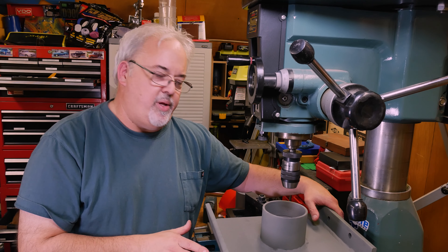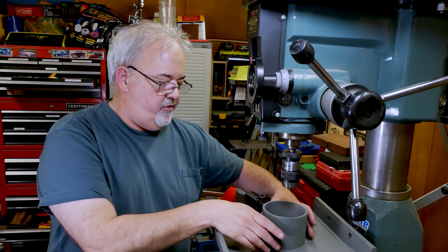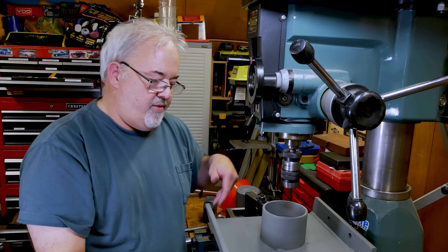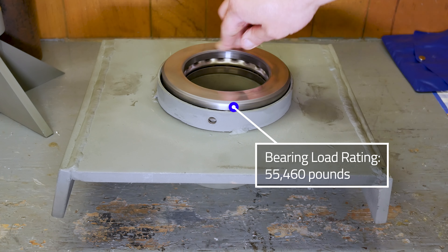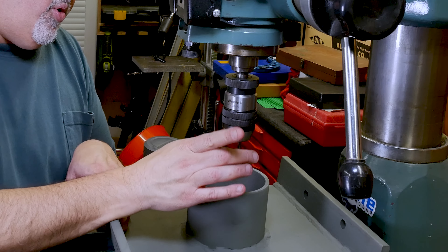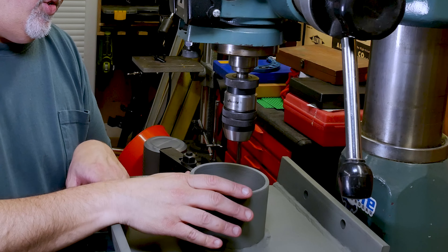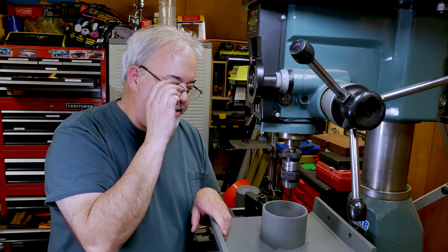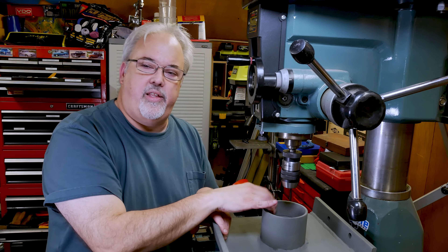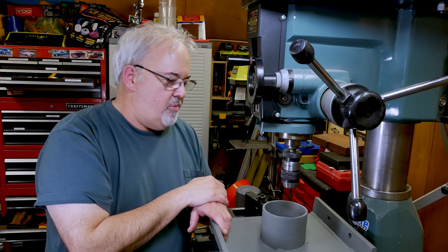I've taken the vise off of the milling machine and I've put this plate on here. This is the top plate of the ride, and this tube here is where the central shaft goes through. Now this is actually sitting upside down. The top surface here is where the bearing goes that the whole weight of the ride rests on. This tube right here is where we're going to push that bearing in that we've been making. The inside of this is all chewed up and needs to be cleaned out. So we're going to get the mill centered up on this and clean the inside of this up. I think the little mill drill here is up to the task.